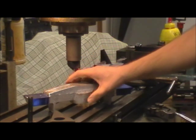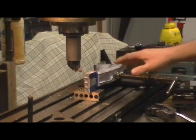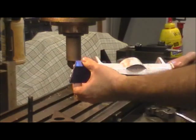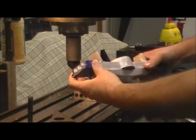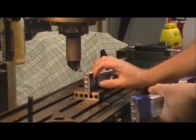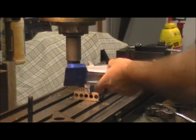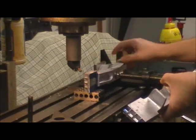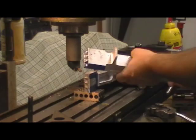Okay, on the bolster, I have this one set up to cut right now, but this is the one I cut previous. We're taking this down to two inches. On the casting it's about two and a quarter, so it's a good bit to take off. The gates were on this part — that's probably why it's a little thicker.